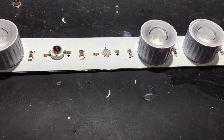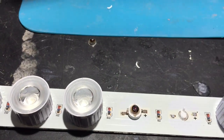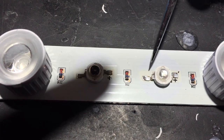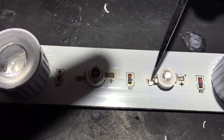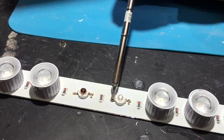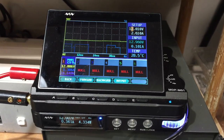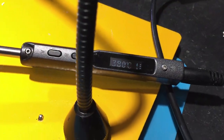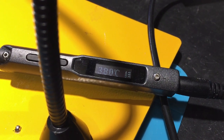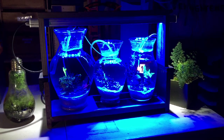First I desoldered the old burned out chip from the board, then applied a bit of thermal adhesive to the mounting surface. If you're planning on refreshing an old LED, be sure to orient the chip properly before soldering. There should be a plus and a minus on the chip, but you can also use the little hole which indicates the negative side of the chip. For my soldering setup I'm using the Miniware MDP-M01 DC bench power interface to drive a TS-100 soldering iron set to no higher than 380 degrees Celsius. The Miniware bench supply is also great for testing LED chips.